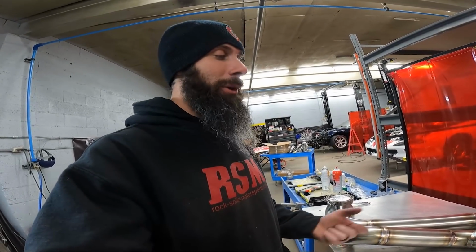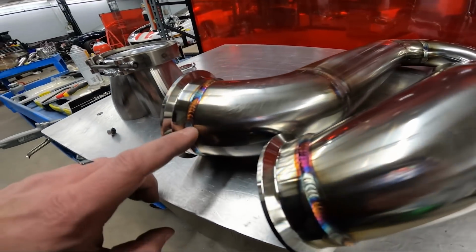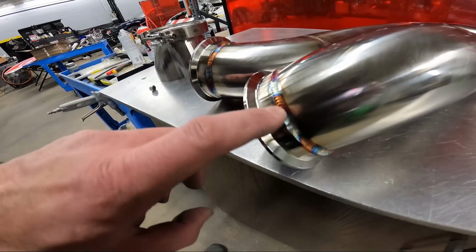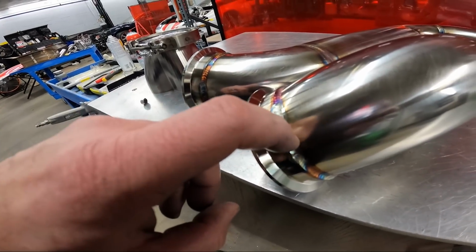So the hot pipes are welded up. You've seen on the time lapse, I weld super slow on these. 3-inch pipe's a pretty big pipe. It takes a little bit of heat to get through it and penetrate it good. But I usually run lower amperage and weld slower because I can keep the weld more consistent. You'll see the welds on the flanges look pretty typical, what you'd see somebody post. They got a lot of color in them and the dabs look pretty crisp.